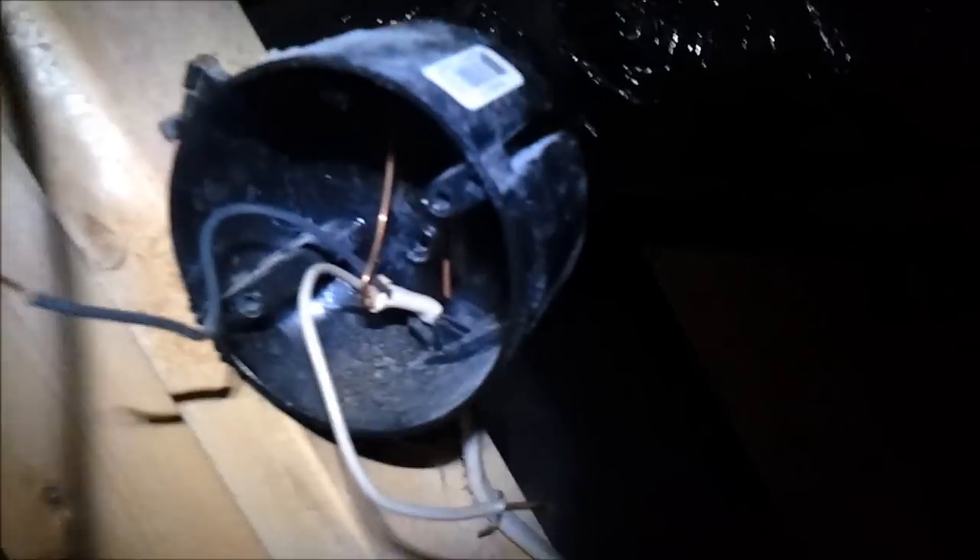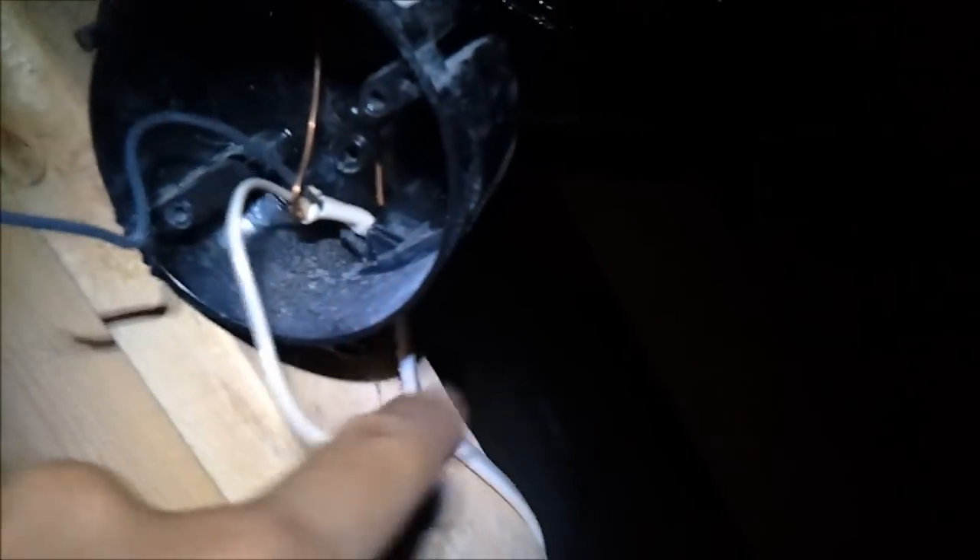What I've done is I've run my wire from my fan way over there — it's barely discernible. Up here I'm going to go into this former light box and patch into this hot wire here. Running it through the back — you have little breakouts in here, so go ahead and pop one out as I already have, and run your wire through there. Then, using your wire nuts, you're going to connect these.